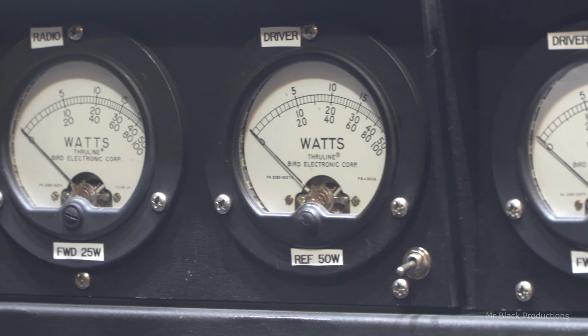But I get on these little solar system groups, and they go off. They don't realize they're giving up like 25% of the performance in their system, because they firmly believe that if you solder an eyelet, it's going to break. Stupid, I know, but they believe in it like Moses coming down off the mountain with the Ten Commandments. No, thou shalt not solder an eyelet anywhere ever. It will cause it to break from vibration. No, you mitigate that risk and you manage that flex.